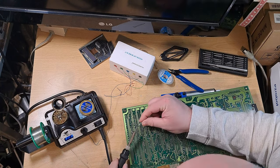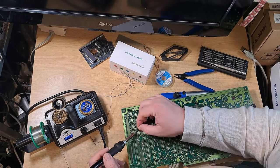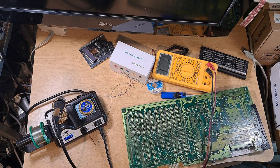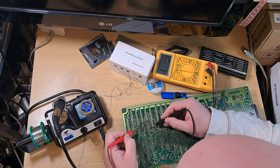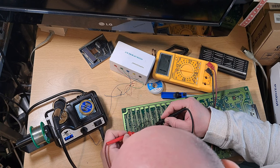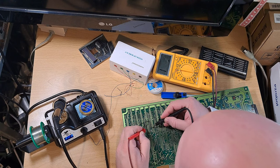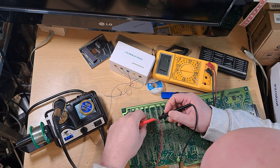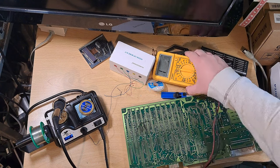What's quite handy is this wire is very small - you can literally pull the insulation off with the end of your finger, though when you go to tin the end of the cable the insulation does kind of roll up a little bit. Now I'm just checking to make sure what I've done is actually making a connection - putting it on continuity mode. Seems to be working fine, getting a continuity beep. Also just making sure I'm not getting continuity with other things it shouldn't be connected to.